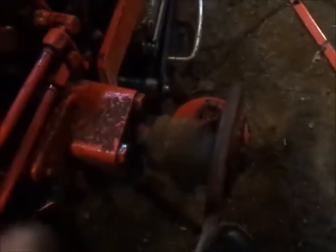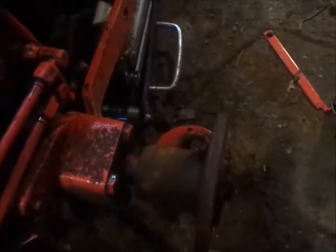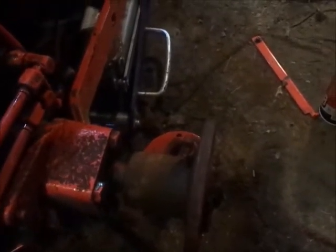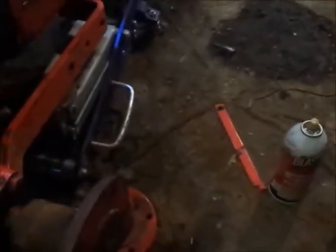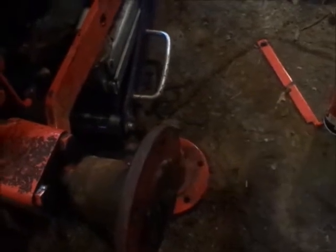It's been a while - I've been filing on this and got it to a point where it was kind of tight. I took my propane torch, put it under it and heated it up, then hammered it down on here. I really should have filed it down some more because now I got the edge of this mushroomed over a little bit. But I don't think you'll ever have to worry about this hub moving again. As long as I can get the outside of the wheel to go on there it will be golden - it's not as bad as I think it is. Since it's my machine I'm not too overly concerned.